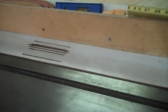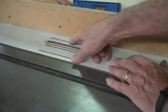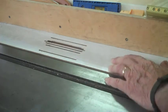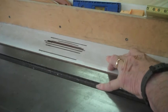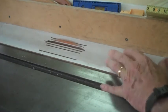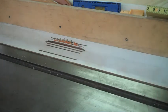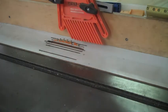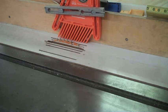Now, keeping your fingers at a safe distance, what you want to do is fire up your table saw and raise the blade to get the saw blade to come up through whatever the location is. Okay, so now you're ready, and if you happen to have fingers that will bolt here onto the side of this, that has a tendency to help keep the thin Formica down. And I'm talking something like this bench dog contraption here. Of course, this is backwards. It would have to be mounted going this way. But anyway, it simply holds your material down.